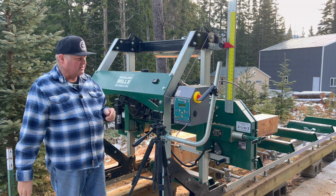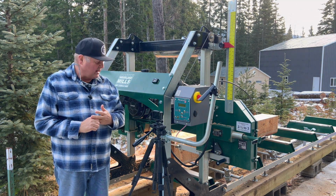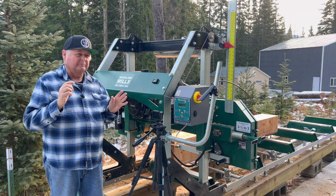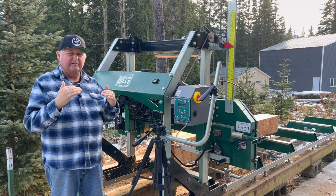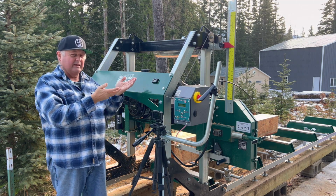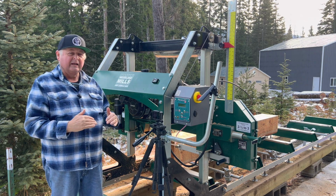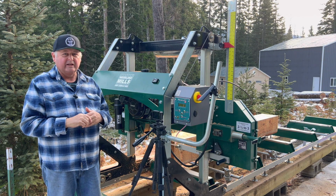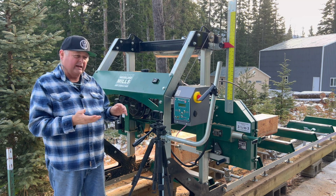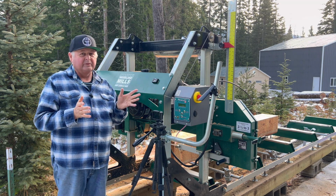But before I get into that, I wanted to bring up a few things, thanks to some subscribers and suggestions from them. Before, when I was cutting, I was using the bump mode and going down the amount that I wanted to go down, and then making my cut, raising it, hitting the bump mode up and going back up, and then hitting it twice to go back down. And the suggestion was made that I zero it after each cut. That way, after making that cut, I go up, it just goes up the once and I just have to go down once again. And you're absolutely right. That is the better way to do it.